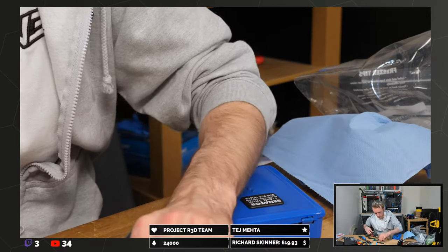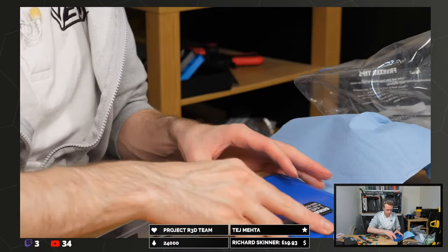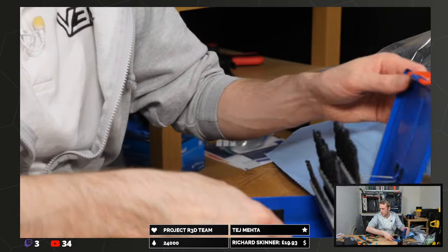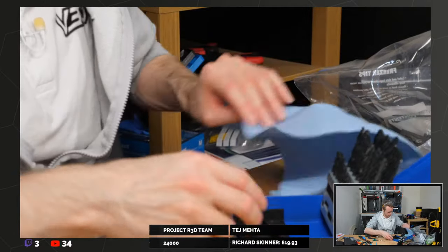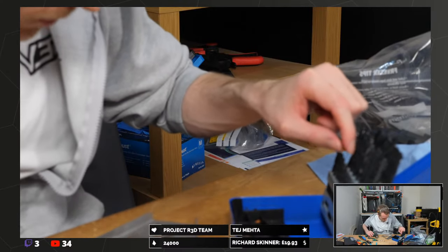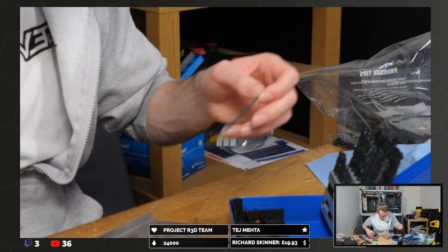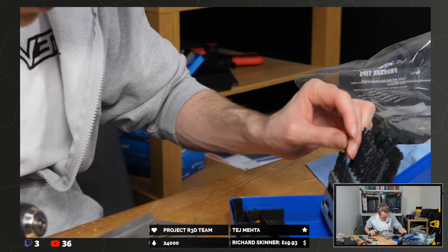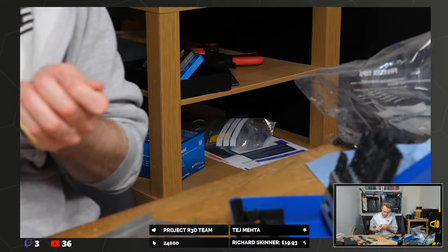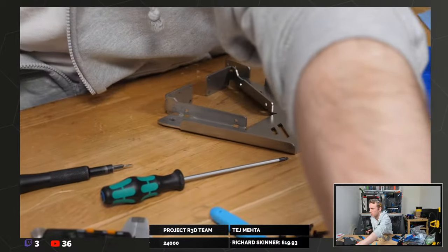I'm going to try it without the TPU spacers first, see if it binds up, and then if it does, then I'll put them in. These are going to be M2, so I would normally do 2.5mm holes for that. Maybe it's a bit much, but let's go 2.4. Should still be plenty. This is like how not to do drilling.